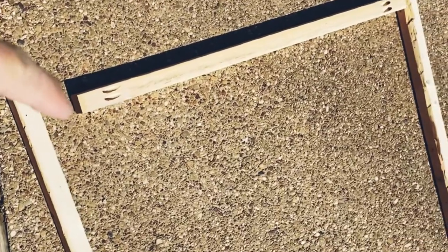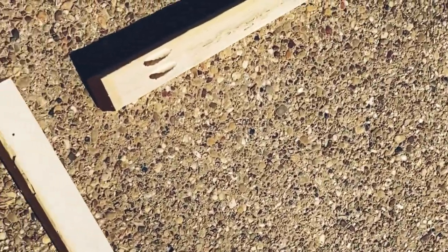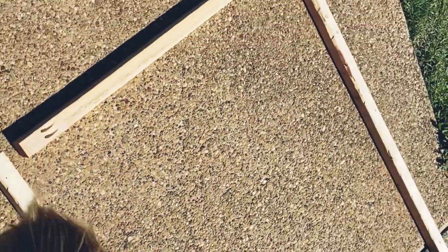I'm laying out the door. I use two-by-twos for the door — they're a lot lighter that way. You don't have all the weight of the bigger lumber, which wears the door out after a while. This is real light. I like to lay it out on the concrete so I know it's nice and flat, and I'll try to get it as square as possible.